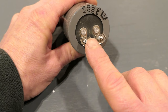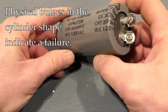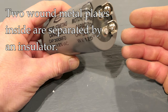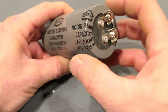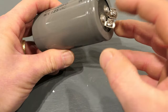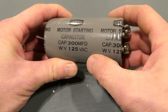Here's a closeup of the two terminals — one is used for negative, one for positive. Now, how do we know if a capacitor is bad? One way is to look for a physical deformation in the cylinder. When a capacitor has gone bad, typically the insulating material between the two plates wound up inside has failed and it'll blow out. You'll often see a dome on the top instead of a flat top — it'll just bulge out. Sometimes you'll see a bulge on the bottom or the side, but most often on the top. If you see that telltale bulge and it doesn't look like a perfect cylinder, then something's terribly wrong. In that case, the capacitor has completely failed and you're not getting any work out of it.